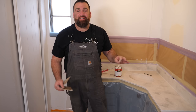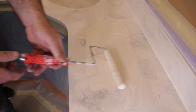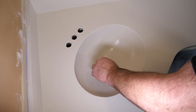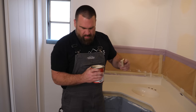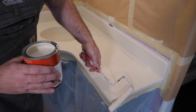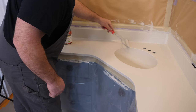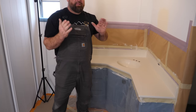That layer of bonding primer is complete. We're ready to proceed like this project is over a sheet of wood. I'm going to apply two coats of paint and make this countertop a very light brown. That's already looking better. Let that dry and come back for the second coat, and then we're going to start building this piece. With the second coat nice and dry, let's get to the next step.